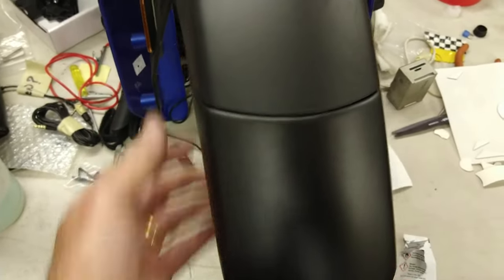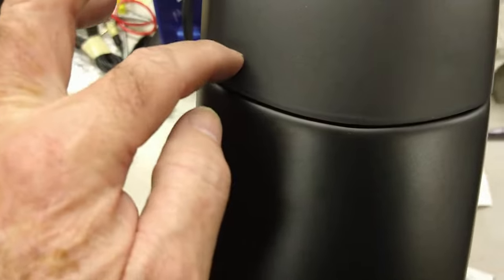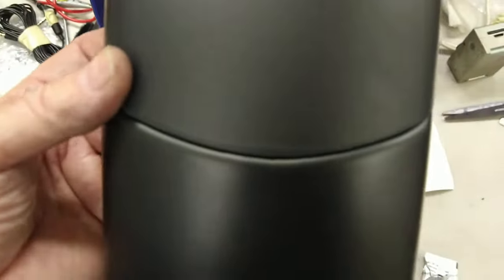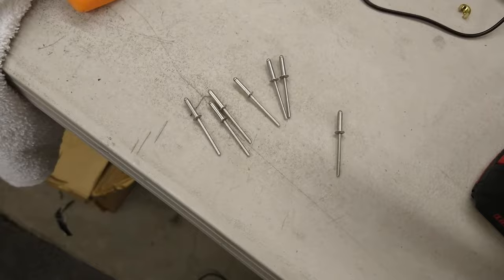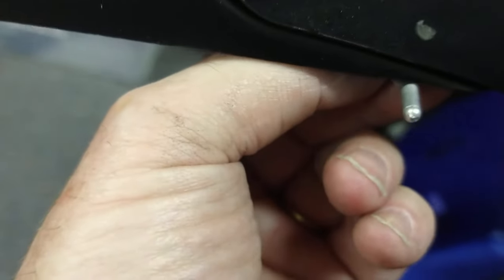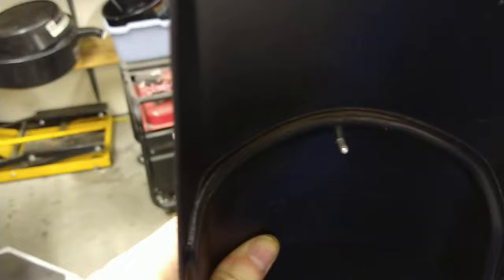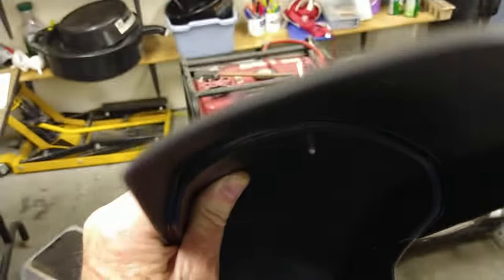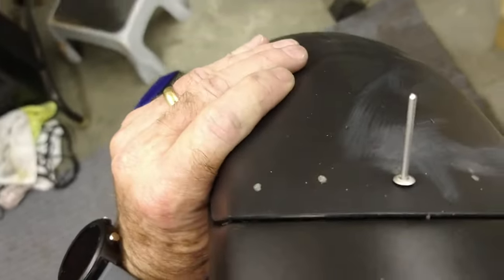This is a piece that's just stuck on, and I'll be putting some rivets in this area here. It's got an overlap on the inside — a pretty good overlap. I've chosen seven 1/8-inch rivets to be used. It's going to be sticking out a little bit here, but I can trim that off if it's a little long. I'd rather have it a little long and trim it off than have it too short and not bite. I drilled the one right in the middle first. You can see where it's going to be sticking through, and it's going to be a little shorter when I end up doing it. Now that I know it's going to work, I'll go ahead and drill the rest of the holes and stick the rivets in to hold their places.